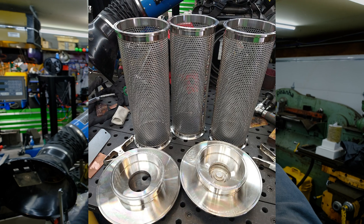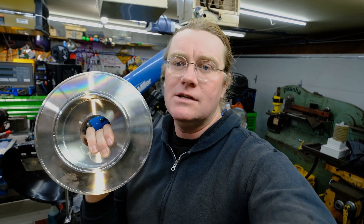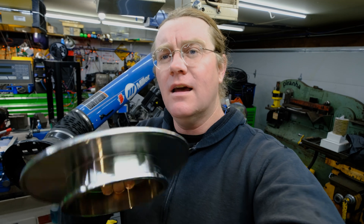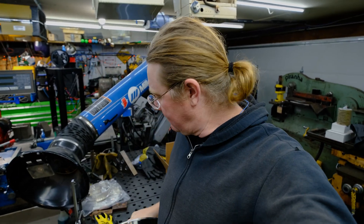Some food product goes down through those strainers and filters before it goes into the pot. I made these to the print I was provided with and it didn't fit, so I got to change these up to make it fit. Fortunately it was not something that I goofed. Let's go ahead and see if we can make these fit — I'm going to cut that one ferrule off on the lathe and turn it down on the Monarch behind me.